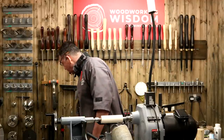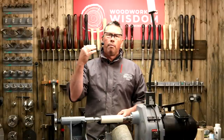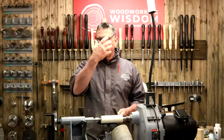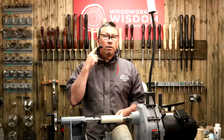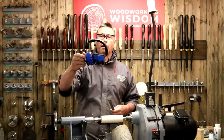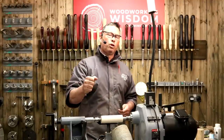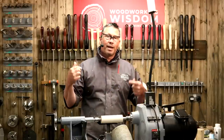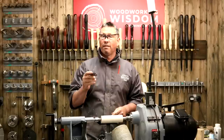In terms of your own health and safety, the obvious things may not be obvious, actually. Eye protection, face protection. Now, I'm wearing goggles so you can hear what I'm saying. But at home, I wear a full face shield that supplies air to me as well. So your lungs, your eyes, your ears. A lot of people forget about ears. Actually, when I'm on my own, I've got a set of ear protectors that go over my mask. Dust extraction, we spoke about that on Tuesday. Really, really important to have dust extraction. All those regular things, tying back your hair, making sure jewelry is not going to dangle in the way, all those sorts of things. So in terms of your own health and safety, those are the recommendations.